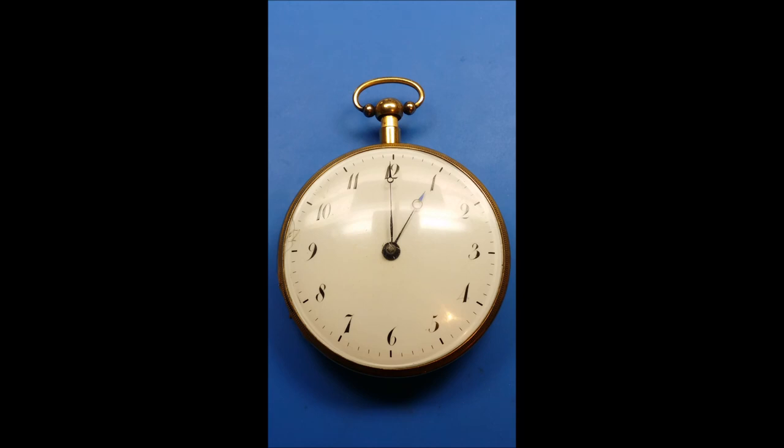When it comes to closing the front bezel again — it's tight — what I like to do is start putting pressure on the bezel towards the bottom towards the hinge and move that pressure up towards the pendant until it snaps. Here we go, reassembled and working. As I usually do, I like to hold on to it for a couple of weeks minimum to make sure it's keeping reasonable time, as well as check the repeater from time to time to make sure it's functioning appropriately, chiming the correct time, and testing the general function of the whole watch including the music box. Thanks for watching — if you haven't seen my previous video, I discuss replacing four or five screws in this timepiece, so check out that video — I'll leave a link in the description below. Thanks again everyone for watching and I'll catch you the next time.